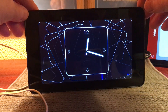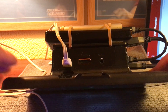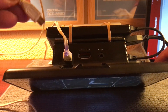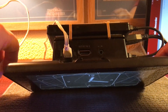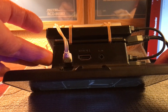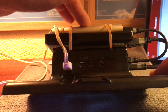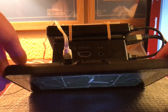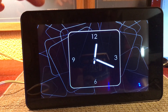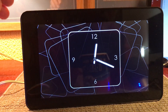What I was usually doing was running two power supplies into my Pi Core Player. So I had one connection at the back and another connection at the front. The front one was powering the screen and the rear one was powering the Raspberry Pi, hard drive, and a USB DAC which I've all got plugged in. Because if I didn't use two power supplies I would see the yellow lightning bolt, which is a warning for low power.